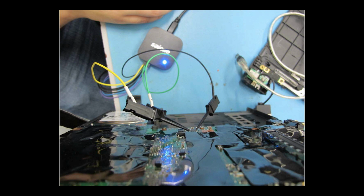So what you're going to want to do is start the capture before the laptop is turned on. And then you power it on, wait for the 10-second boot, or not boot, but POST and stuff like that. And then eventually you'll come to that terrible password screen again. Guess a couple passwords. It's going to tell you that they're wrong because you don't know the password. If you do, why are you doing this? And then once you're done, you stop the capture.